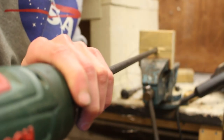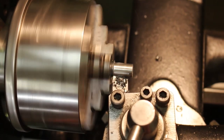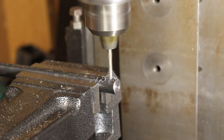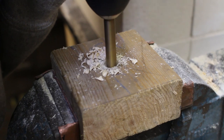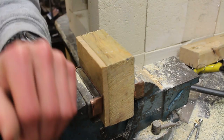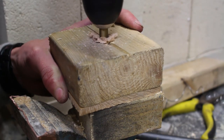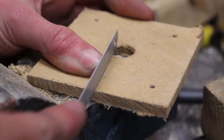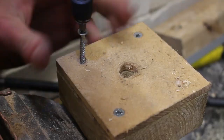The first thing you need is a long metal rod which the coils are going to be wrapped around. I'm using a piece of 12mm steel round bar - it's slightly too wide on the end to fit in my drill chuck so I'm going to turn it down on the lathe to 10mm on the end. I then drill a small 3mm hole in the other end. Then I make a guide block of wood by drilling a 12mm hole through it that will tightly fit the shaft of the guide rod. I attach a thin piece of MDF over the top, transfer the 12mm hole through, then enlarge it to 14mm - just slightly larger than the coil will be when wrapped around the rod. I then use a hacksaw blade to make a guide slot wide enough for the wire to fit through.